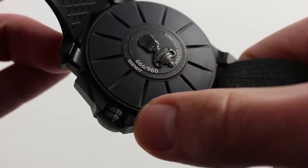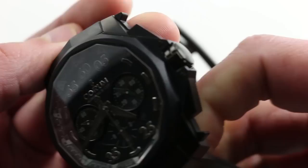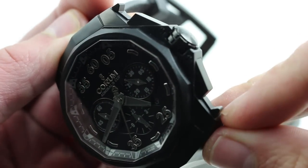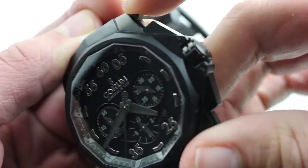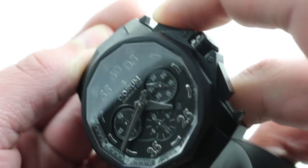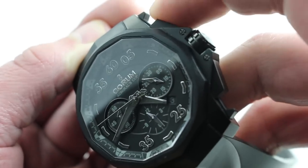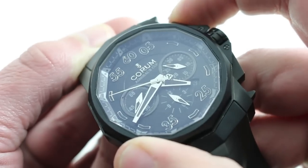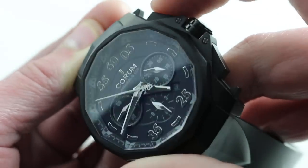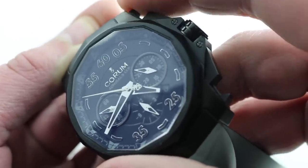The screw-down caseback and screw-down crown ensure 300-meter water resistance, so this is a true tough sports watch in every sense. It also features an unusual refinement for the 27-jewel 7750: chronograph pusher locks. Here's how they work — you pull them in and they secure the chronograph against actuation, either due to water pressure, as Richard Mille secures its own chronographs, or due to accidental blows. Pull them out and you can actuate the chronograph functions.